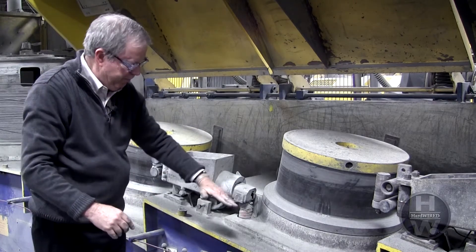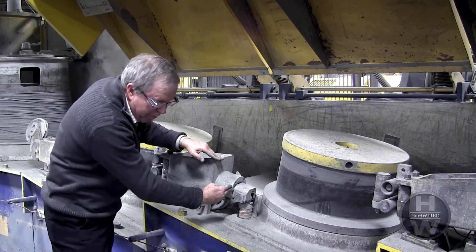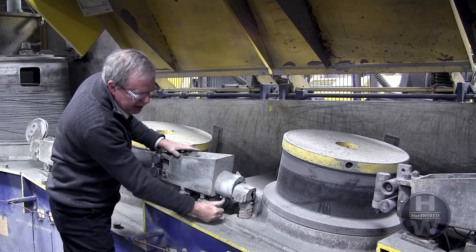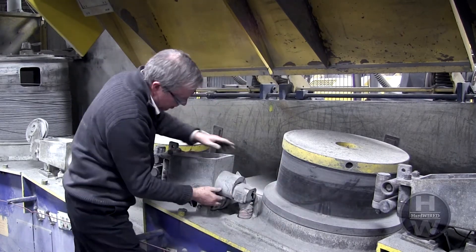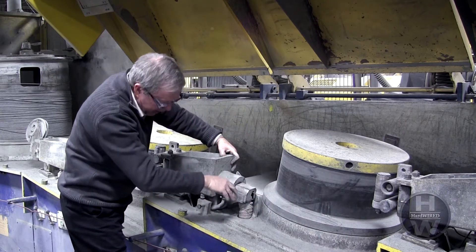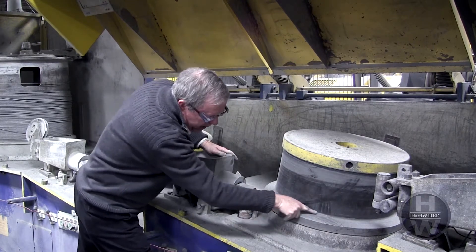For the helix, if my wire was shooting up on the block — after I cut it right here and I noticed that it's shooting up — I want to move the mouth of the die box up. If my wire is shooting up, you move the exit end of the die box in the direction that the wire is curling. So if my wire is curling up, I move the front of the die box slightly up. If the wire was curling down, I would move the front of the die box down. You want that wire, when you cut it right here, to be laying perfectly even with the radius of the block.